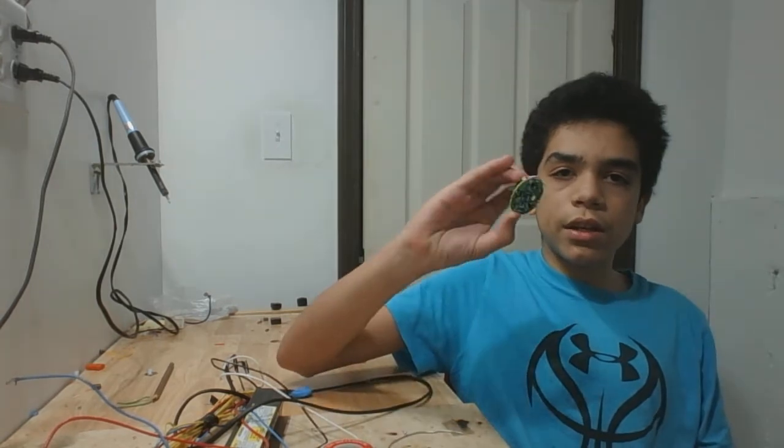Now that we understand what a flyback transformer is and how it works, let's get to the project. For the driver circuit, we need a high-frequency switch that operates at about 10 to 25 kilohertz. So I figured that I could use the circuit found inside of a compact fluorescent light bulb, a CFL. This circuit can switch current to the flyback's primary at about 20 kilohertz, which should be perfect, right? Wrong. That circuit can only deliver 20 to 30 watts, so it blows up as soon as you connect it to the primary of the flyback transformer.